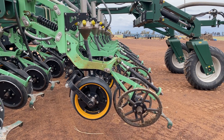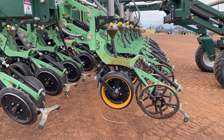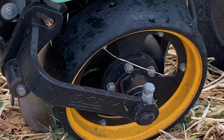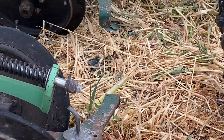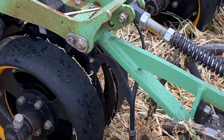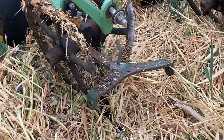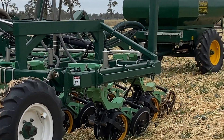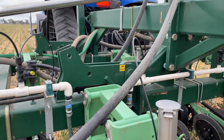Last night I ran that on — just did it with the machine out of the ground and drove through it and blew the seed on top of the ground. And then today we're going to come back through and put these things in the ground, so we'll drop them in about two inches deep roughly. We're going into dry soil, which is not something we've ever done before, but I know plenty of people have dry planted in the past. From a little trial last night when I was doing the fenugreek, it seemed to work fine going straight up the rows that we planted the winter mix into. I'll be aiming at doing that again — just go straight up that row and drop those five things into that slot. The twin discs seem to work pretty well in our conditions; there is also a single disc one available, but we use the double disc planter.